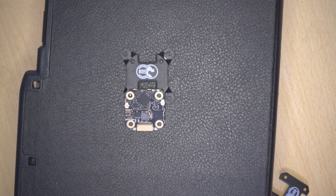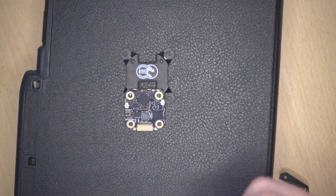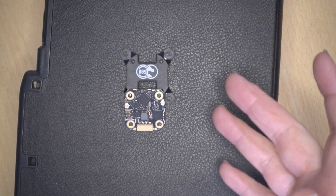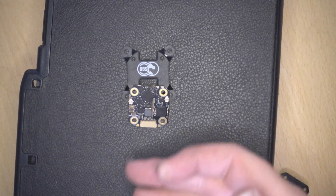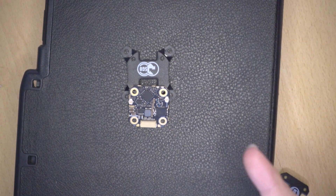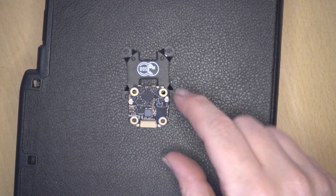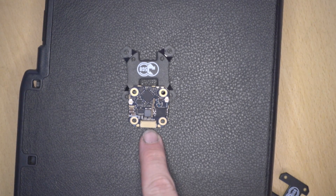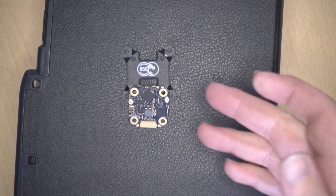There's a new firmware — still in beta but should be production soon — which re-enables Smart Audio. It lets you put it on one of the two UARTs: Crossfire on one UART and Smart Audio on the other. Unfortunately that means if you also want to use MAVLink you'll run into issues, so there is a compromise. It's a shame it wasn't thought through from the beginning, but better than nothing. They could have put Smart Audio on the audio port like older Unified Pros, but I'm happy since I don't use MAVLink.